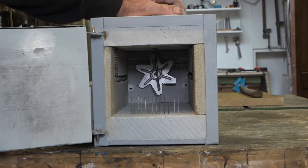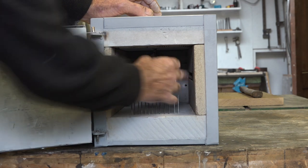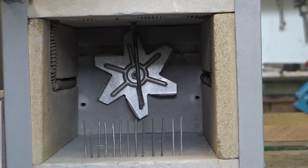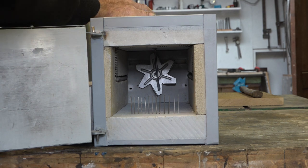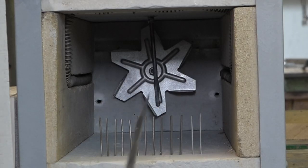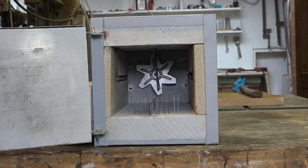What I ended up doing was swapping out the two-inch refractory on the sides for vermiculite, and I just ran one element in. The element comes in from the back, crosses over at the front, comes back down and goes out the back. I also fitted a fan assist to the back which is absolutely exceeding my expectations — it's awesome. The thermocouple is right in the centre of the oven, right at the bottom, and that sits just about on the blade. I could take it down further but I don't really want it to interfere with the knives, and it's getting a good reading of the temperature there anyway.